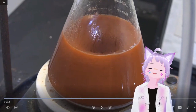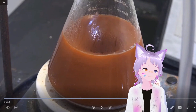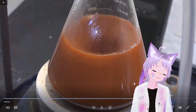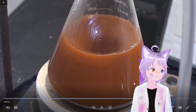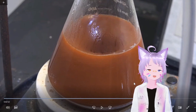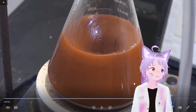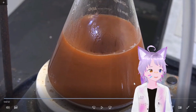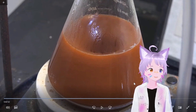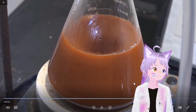Well, it depends. Like, you know those reactions that foamed over? If you're going to set up on a large scale, you need more control. But those other ones that don't, yeah, sure, why not? I mean, after all, it's a job to see which reactions are scalable. As you know, chemical engineers, if you were working on an actual plant, you're asked to scale up a lab process. You try to find out everything about it: how much heat it produces, how much heat you need to put in, how big the requirements are. Given all those parameters, you design the appropriate setup, and Bob's your uncle. Get some poor sap to build it.